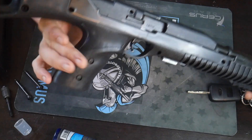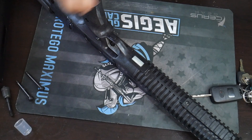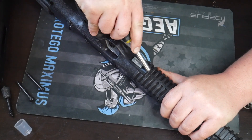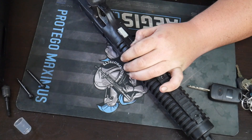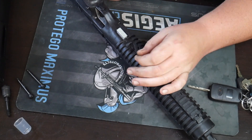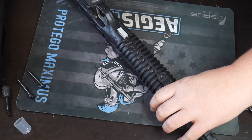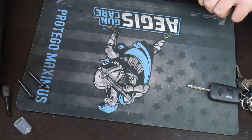Now you're at this configuration. There's this little spacer bar that you can use your takedown lever on, or to make it a lot easier, use a screwdriver that has no bit — just use the flat part and push it forward. You might need a little bit of leverage if this is your first time taking the gun apart. Take this little U-clip and put that to the side. Now you can lift the receiver out of the stock.